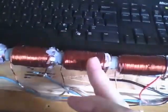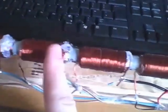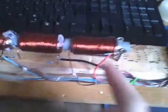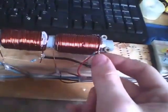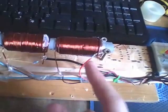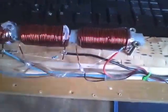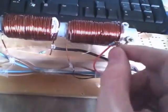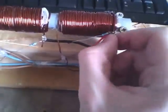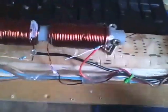I'm using 16 gauge copper wire. I don't know exactly how many turns there are, but I know I've done it four high by about 15 turns. I'm going to have some M10 10 amp 1000 volt rectifier diodes between here and here, to kill the leftover current after I've turned off the coils, so it doesn't pop the MOSFETs — the MOSFETs would pop because of it.